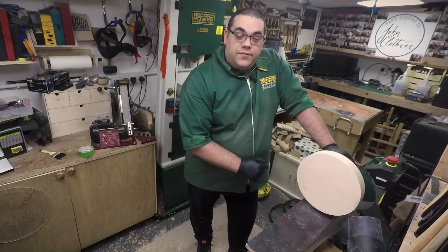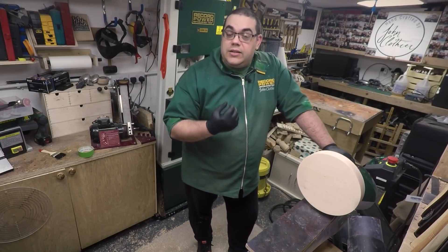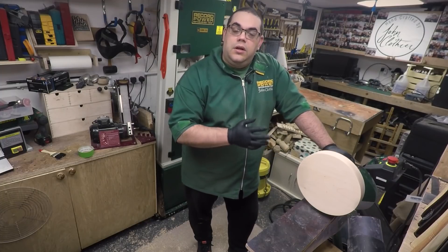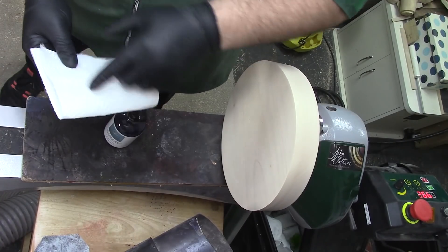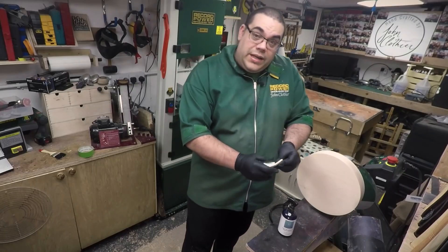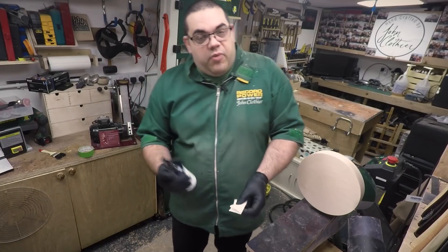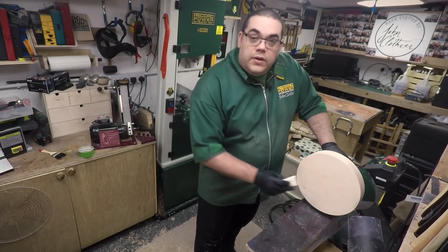Now I've picked a particularly boring piece of sycamore here — there's not really a lot of grain pattern going on, and this is ideal for colouring because we can do some really quite exciting things with colour that otherwise wouldn't be there with this wood. To start with, I'm just going to colour it blue just so that you can see what it looks like, and once we've done that we'll move on to the next technique. So take yourself a piece of kitchen paper, fold it up and make a nice pad with it. We can then put our colour onto the tissue — face away from the piece because otherwise you'll end up getting some overspray on it — just spray a couple of squirts onto the tissue and then all we need to do is just apply it.